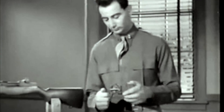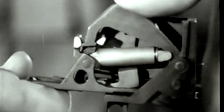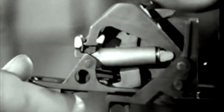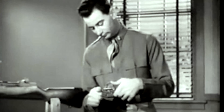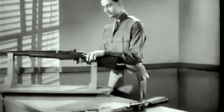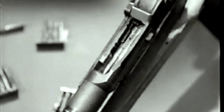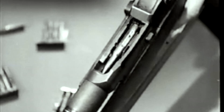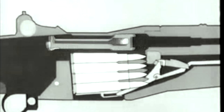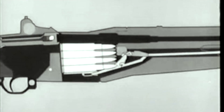Let's take a look at this same action on the rifle itself. Here's the trigger mechanism. Watch the hammer move up and catch on the trigger lug as the trigger is released. It's a very slight movement. Now as the bolt reached its rear position, the magazine was uncovered, allowing the empty case to be ejected. We use the diagram and take the bolt to the rear again. Notice the follower move up, pushed by the follower arm, rod, and spring. It pushes the next cartridge up into feeding position.